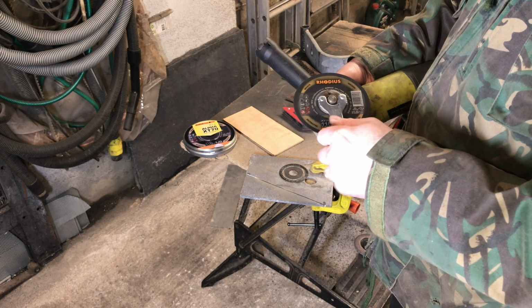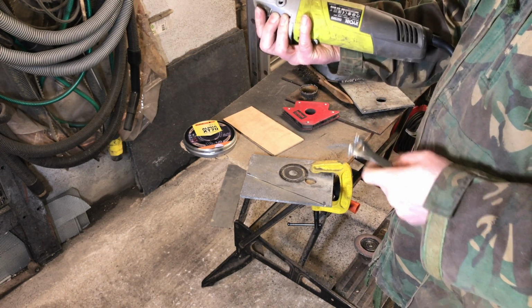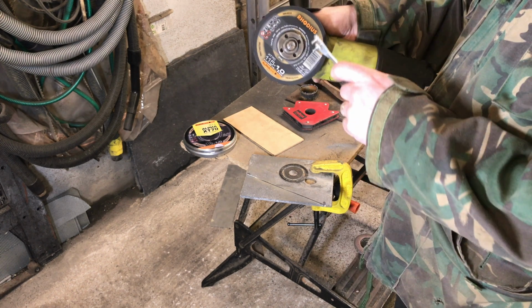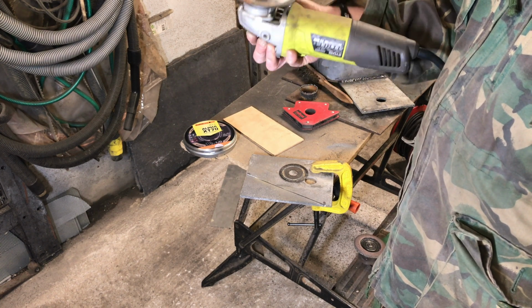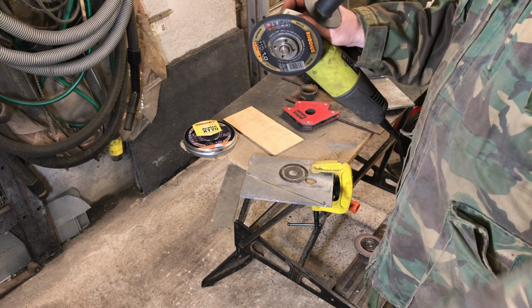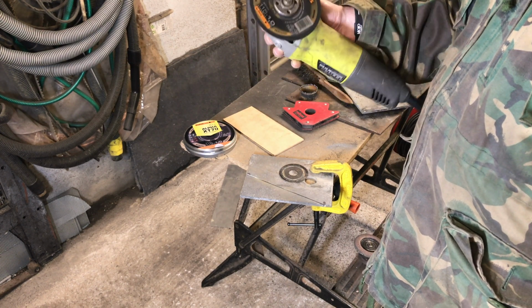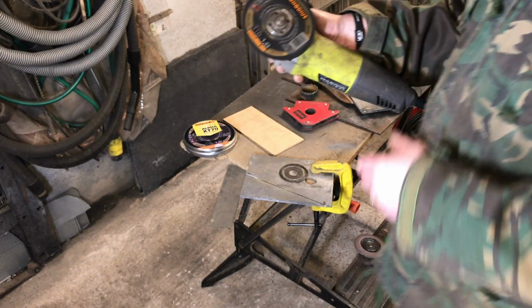They're only 1mm thick cutting discs, but then that's all you need for steel. You don't want 2.3 or 3mm thick blades. I learned about these some years ago, and since I found them, they're really good. I used to use, I think, 3mm thick ones. They cut steel, but it was a dreadful job. But yeah, these go through like a hot knife through butter.